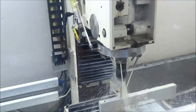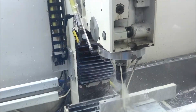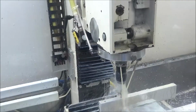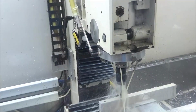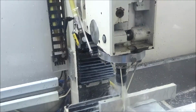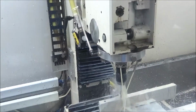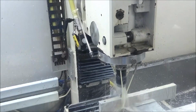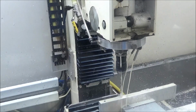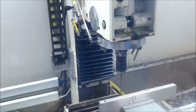It's a little tough to get coolant in the right place, because the next tool is so much different than the first two that you had to kind of find a happy medium. So luckily drilling doesn't take too terribly much coolant, but you need to get some in there every now and then, and that hole should fill up pretty good with the coolant. As that thing comes back out and goes back in, it should have enough coolant down in there to work. It would be different if you were drilling 5 times the diameter or something and it just kept emptying out the hole. So at least pecking like that, it kind of helps out.